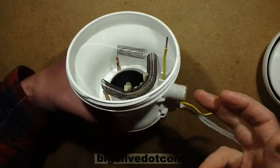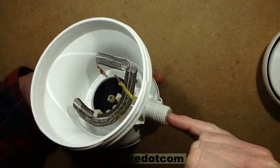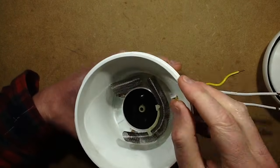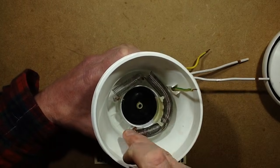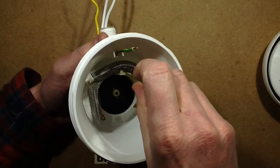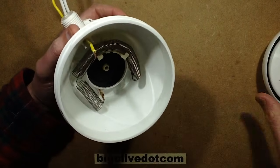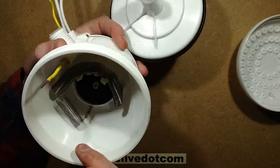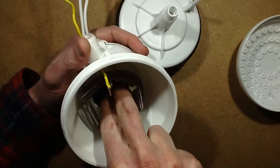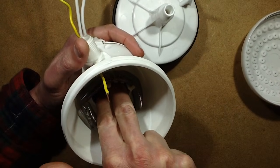So it doesn't have that thing typical wall-mounting showers have where when you turn it off, you can hear a whoosh as the water boils inside the heating unit. The water is exposed directly to the element. The water comes in here, flows past the earth wire — it turns out there's a bit stripped down at the bottom as well, because that's also earthing protection to stop the pipework becoming live. This wire has two bare sections: one at the output and one at the input. There are three connections: a short section of heating element, then a longer section. The water has to come in, circulate around the element, go right up to the end and then down, so the element is always submerged. Once the pressure is on and the water is being restricted by the outlet jets, it pushes a diaphragm and that's what makes the electrical connection inside.